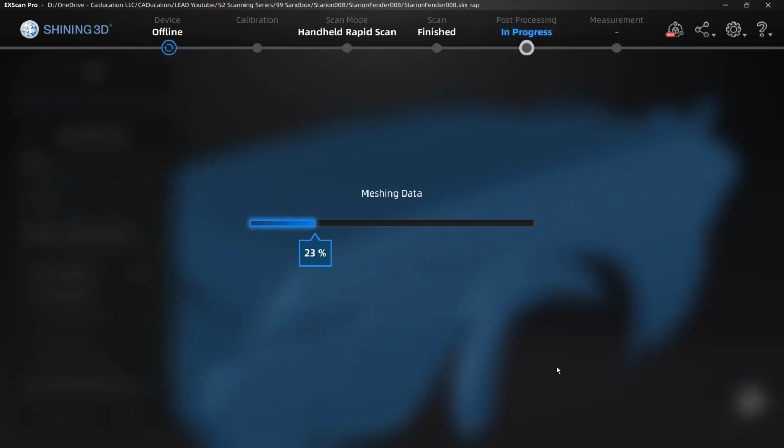As I mentioned before, the computer I used to scan was a laptop. It's different than the machine that I'm filming this on right now. The machine that I'm using now has a much faster processor, but a much lower graphics card, so I don't quite have as many CUDA cores. It doesn't really have the same GPU. But what I've noticed is that on the laptop, ExScan was having trouble utilizing the GPU. Here on the computer that I'm using, even with the much lower graphics card, it's able to access the GPU because it's not feeding it through the onboard graphics card in the laptop.